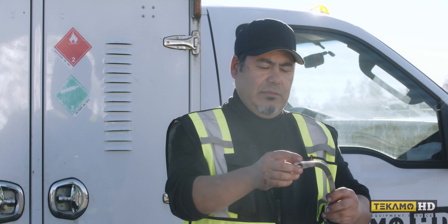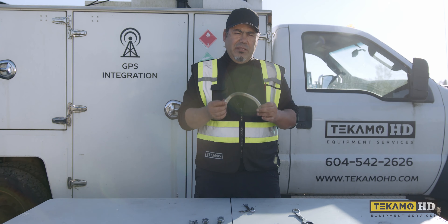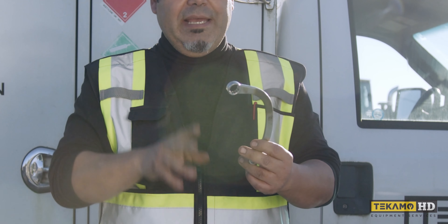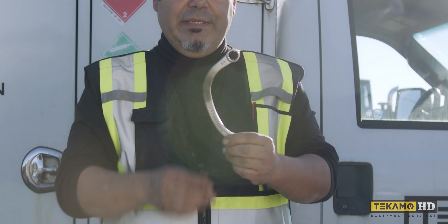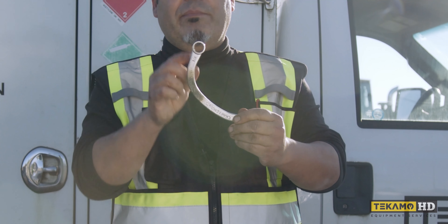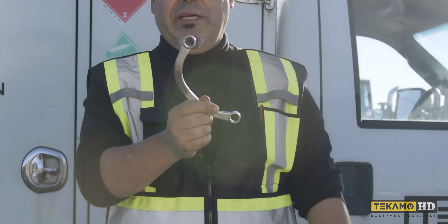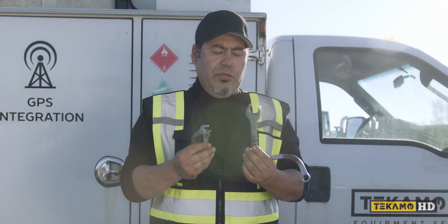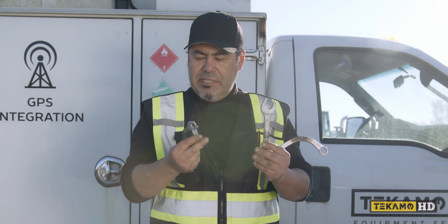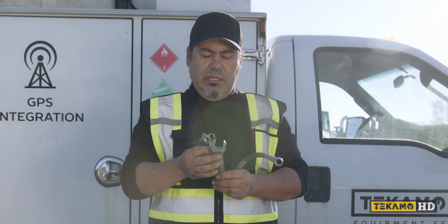Another interesting one here is actually made for a Cummins engine, for removing the fuel pump and the air compressors. It has — I can't remember if it was three bolts or two bolts — and they're just between the engine and the component. So you have to make a tool and bend it at just the right angle so that you can get that bolt. By heating it up and bending it, I was able to get the job done. A lot of tool manufacturers now make them in these styles — they're ratcheting, made based on the requirements of the technician.